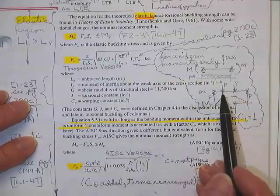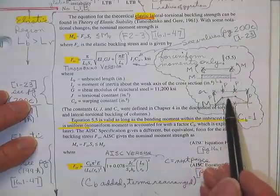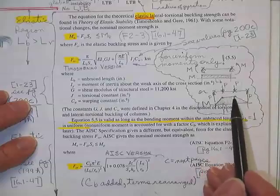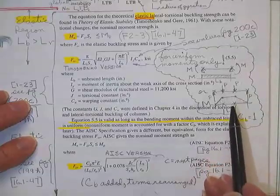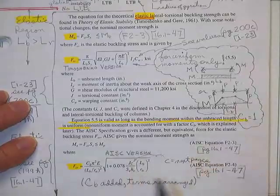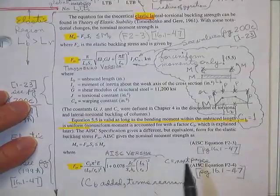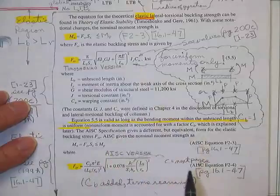And you have a brace and a brace and a brace because this is the worst moment. You'll be studying this region between these two brace points, and it's a constant moment. Timoshenko's equation is perfect for that case. What Timoshenko's equation is not good for, because he didn't test it and he didn't have a proposed solution and